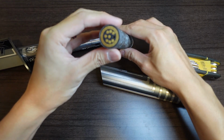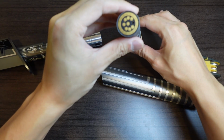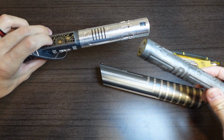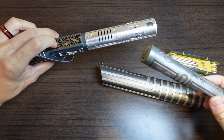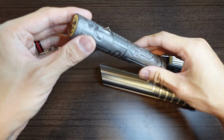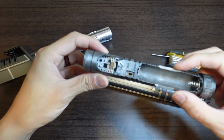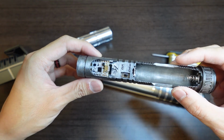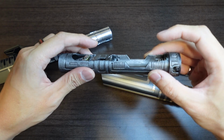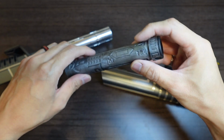I've got a custom 10 connection chassis connector that I designed. Basically for this one, I wanted to control the three pairs of LEDs on the switch card, as well as the touch buttons. And then 4 more connections for NeoPixel with blade detection. Up here we have our Proffie 3.9 board. We've got a kill switch, a battery holder here, and then a 28mm Dark Side Smuggler's Outpost bass speaker.